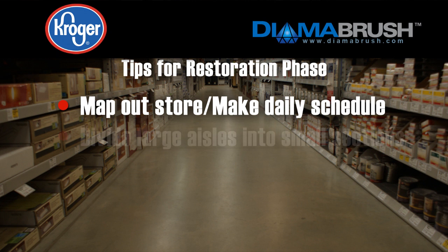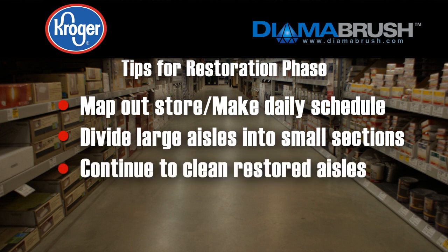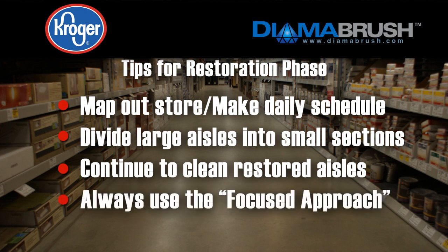When focusing on longer, wider aisles, such as raceways, restore small sections at a time. Again, these small sections should be no larger than 500 to 750 square feet. These aisles are much larger than the individual side aisles and will take multiple days to complete. During the restoration phase, always remember to routinely clean the aisles that have already been restored to maintain their polish. Taking this focused approach to polishing the floor results in a polished floor quickly and evenly.